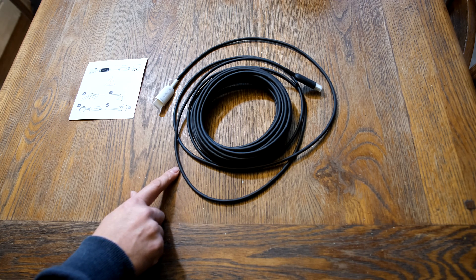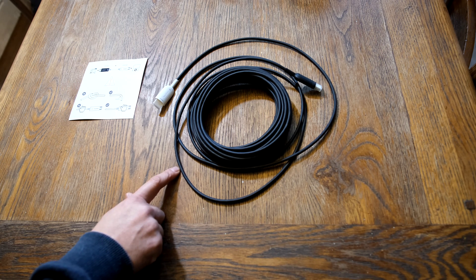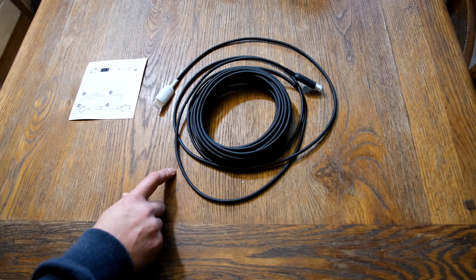The reasons I use optical HDMI cables are longer runs, stability and reliability, and performance — whether I'm doing a first fix on a new house build, a cinema room install, or running from an AV rack to a projector. I find conventional HDMI cables aren't reliable over 7.5 meters, so I generally turn to optical HDMI cables for longer runs.